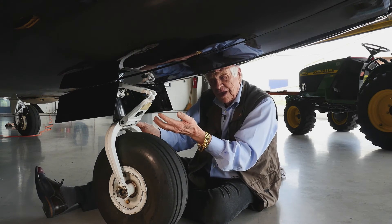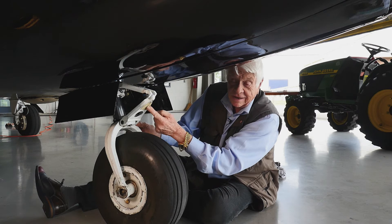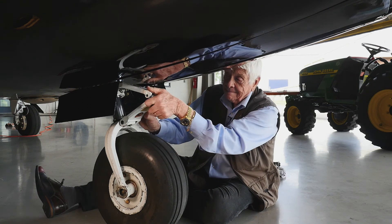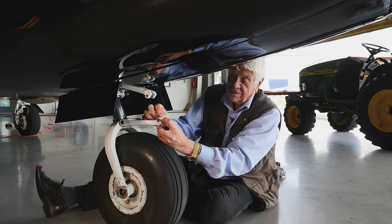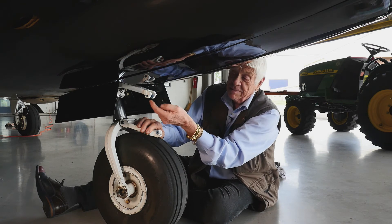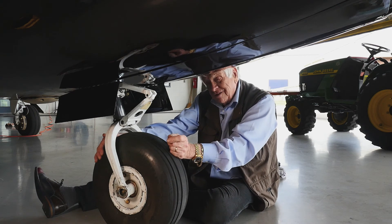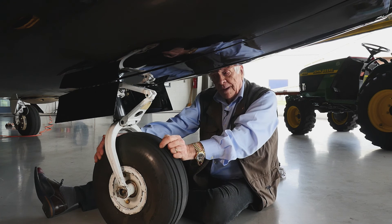We put a pad of Thor tape on the bottom link here, because when this bottom link falls down it's going to run on the tire — this prevents the tire from wearing the bottom torque link. We've made these bushings as long as possible, longer than the OEM ones, to maximize the load-bearing capability. The material is called Aero Tough — our parent makes it for Thor, for Marsh Brothers Aviation. It's made only for aircraft and it's an amazing product.